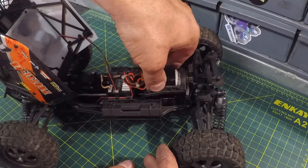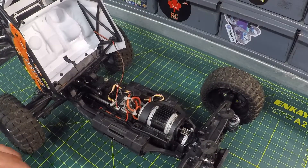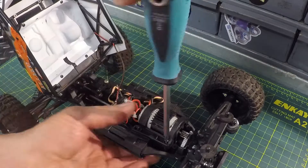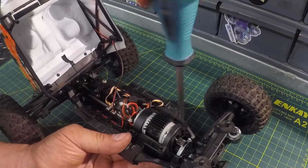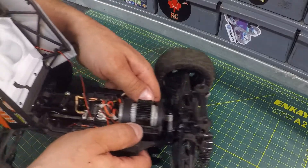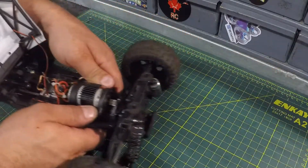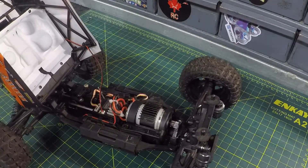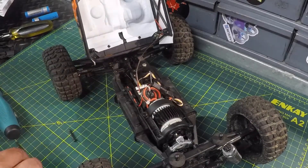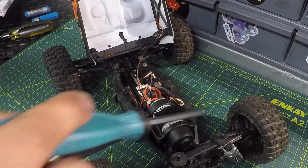We're going to flip that motor back into place and reinstall the four screws that we took out. Got those four screws in there — just snug, not tight yet — we're just going to make sure everything is meshing nice. That seems pretty good, so we're going to finish tightening those up. Motor is mounted, gears are meshing nice, it's greased up. We're going to put the dust cap on — it slips over the top. Three screws: shorter one at the front and longer ones on either side.